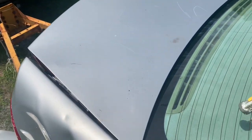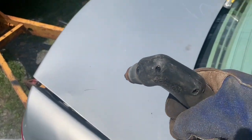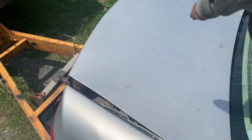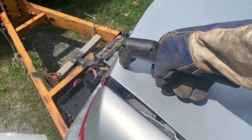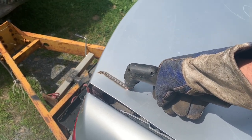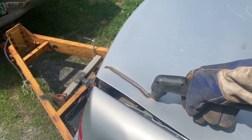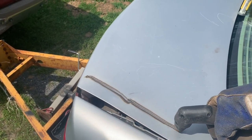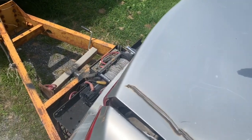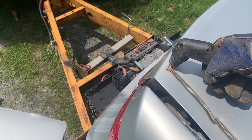All right, so I forgot the GoPro today, and to go get it would be a 4-hour drive, so we're using the phone. And yeah, sorry about the poor quality for like the best video on this channel. Anyway, let's get started on this trunk here. As you can see, the cutter stopped cutting because it kept arcing where the connection was for ground. So we had to reset the connection. I'll skip forward to when the plasma cutter was actually working the way it was supposed to.